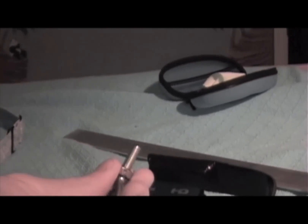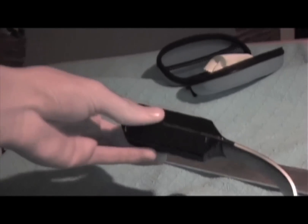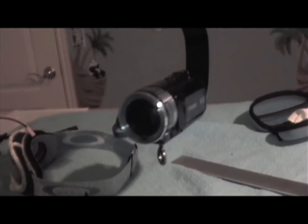Here's another camera-related thing I made. I do a lot of ski and bike videos, and I built this little camera holder so when you're skiing really fast you don't have to hold the camera with two hands. I basically built it out of a big aluminum strip from Home Depot and a little eye bolt — I bent the aluminum into shape, drilled a hole, and screwed in the eye bolt using a one-quarter inch bolt. Then I glued foam to the top, taped around it, and painted the whole thing.